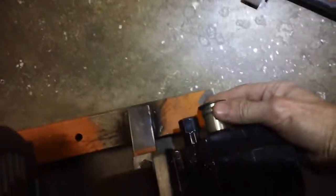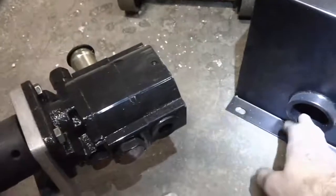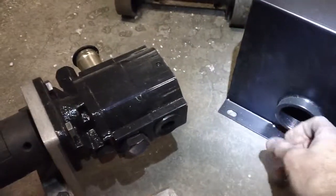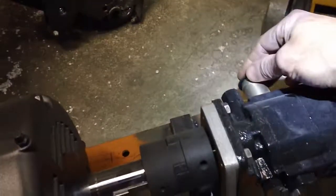The piping over here — this is the suction pipe and it's a 1 inch low pressure line coming from the tank. The tank is over here. It's one and a half inch at the tank so I'm going to have to bring it down to one inch and bring the hose over to the pump inlet.